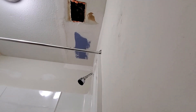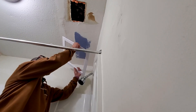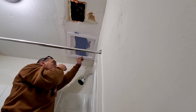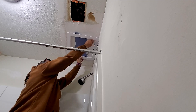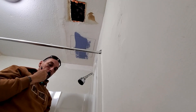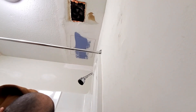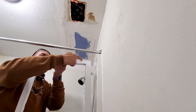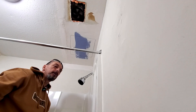When you get your access panel, I like to set it up so I'm right up against the ceiling, dead center with the shower head, then ring it around on the inside. I know I need to cut on the outside of that line — if I cut on the outside line I know it'll be tight. You don't want it real loose. Once you've got it cut out, you'll just run a bead of power grab around the rim and stick it up there and that'll hold it in place. Let's get to cutting.